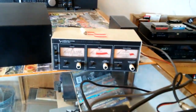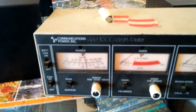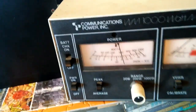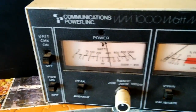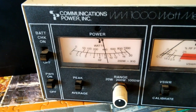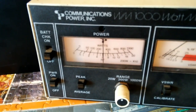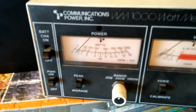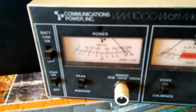This radio is putting out two watts, so let me show you what this amplifier is doing. I'm getting 80 watts flat key with the carrier on high. Switching to low, it drops down to 60. Giving it some audio now — hello, radio, one, two — testing with voice.